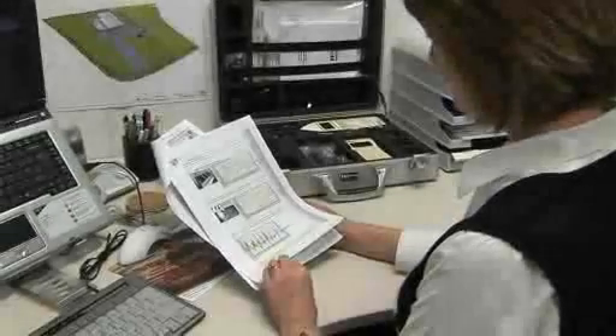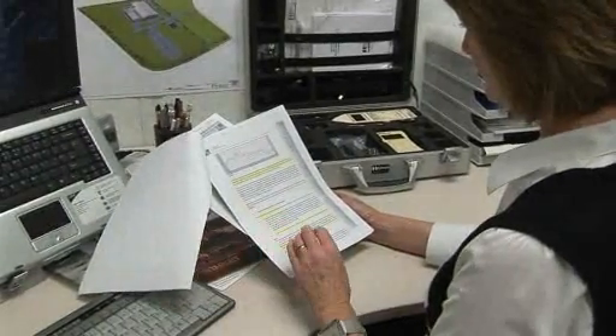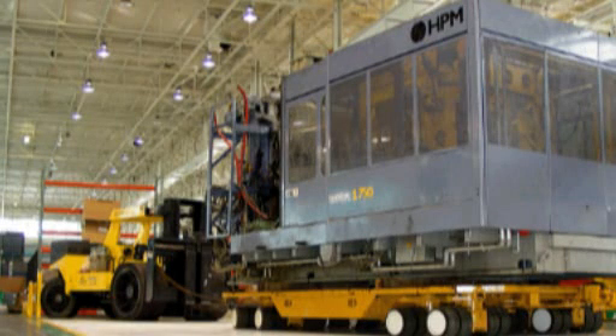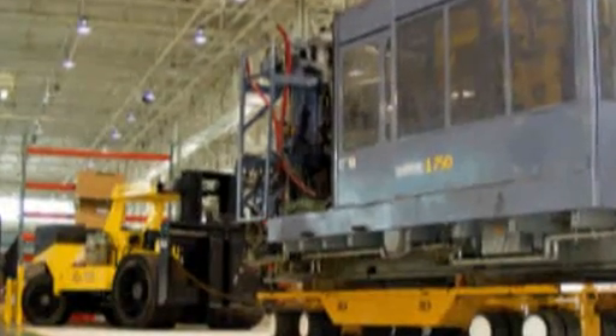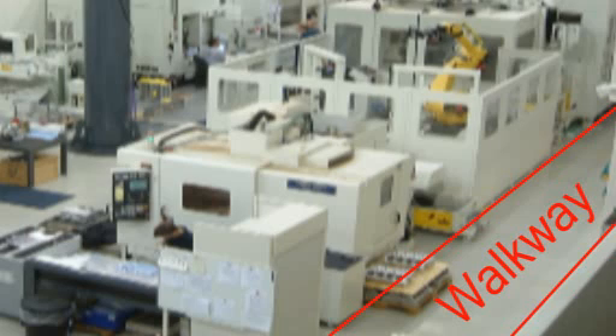The principal aim of a factory noise survey is for it to be carried out in a reasonable time frame with the results communicated to management using a report with actions and timescales. In most cases, noise surveys should be carried out every two years, or sooner as partial surveys if an area changes due to, for example, a new piece of equipment or process. The object is to assess the risk to personnel, so don't bother with walkways or areas where no one works.